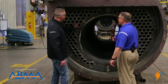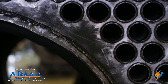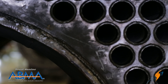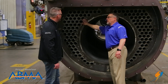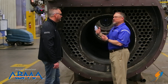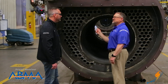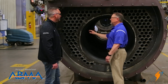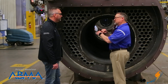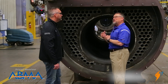It's very critical that the tubes are not sticking out too long. Typically we have a 1/16 of an inch sticking out from the tube sheet for the weld process. If it's an expand roll and bead, you typically have about a 3/16 inch distance outside the tube sheet, which allows a nice clean bead when doing the beading process.